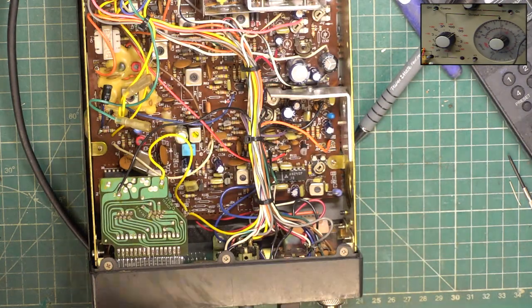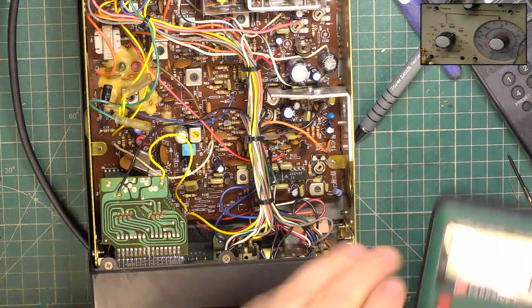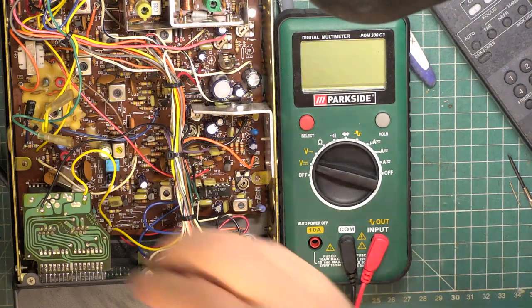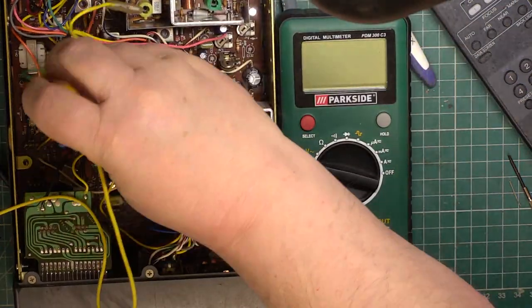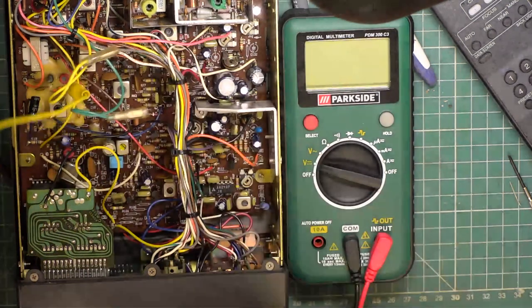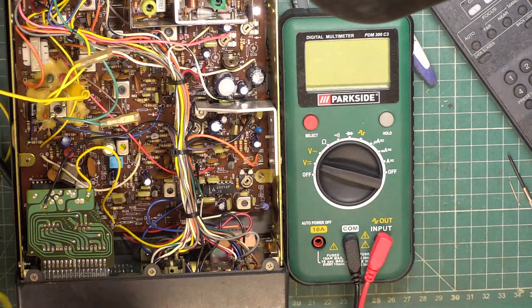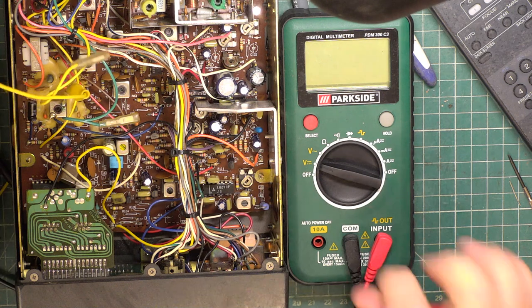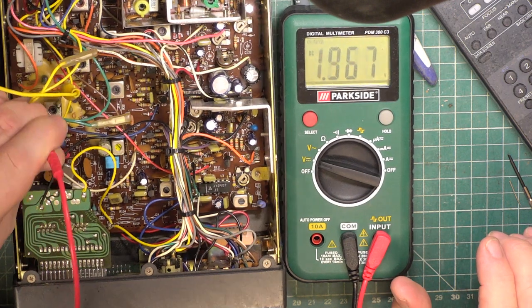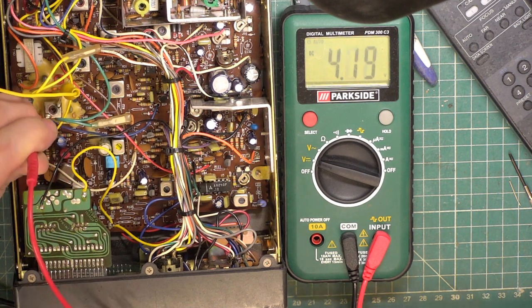Right, so we'll start off with the VCO. I only did one yesterday, so I might see if I can remember the procedure. Don't need picture in picture on for that. So Mr. Chippy's crocodile clip, until such time as we officially open the box kindly sent to us by Alan, which I know contains crocodile clip leads. I don't remember that capacitor before. So resistor 4 should be 4 volts. So we'll just pop that down a fraction.